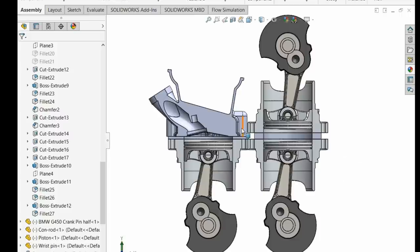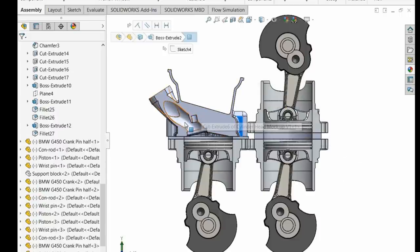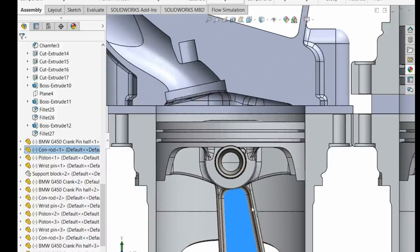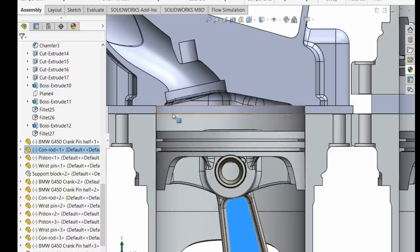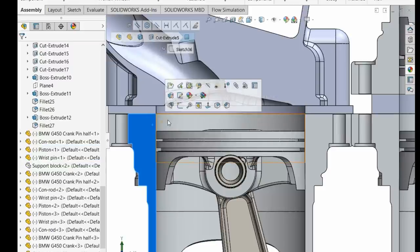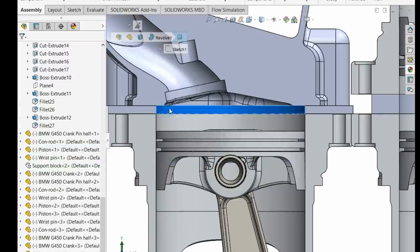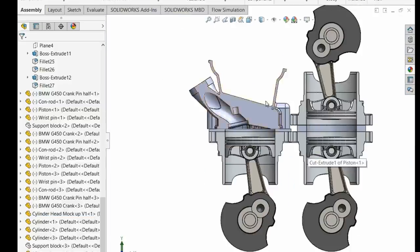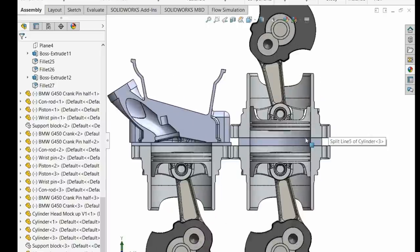You might think, well, there's a lot of thermal mass in this head, right? There's a lot of heat. So when you get a combustion event, it goes boom there. You've got your hot combustion gases in here, right? You leak heat to the piston crown, you leak heat to your cylinder wall, and you leak heat to your combustion chamber, and that means its thermal efficiency isn't that good.